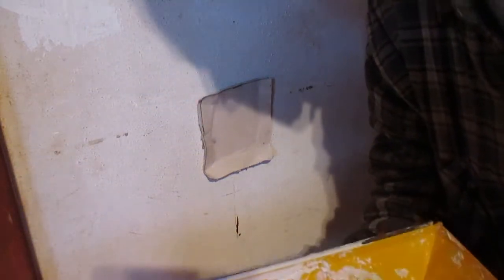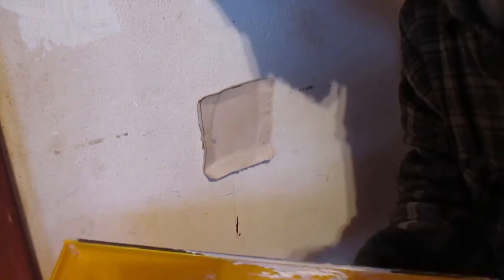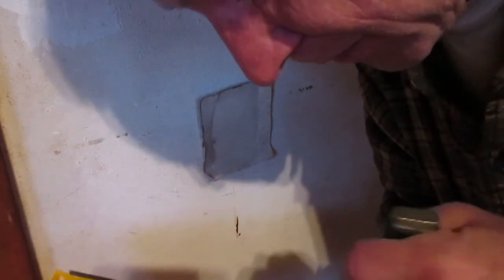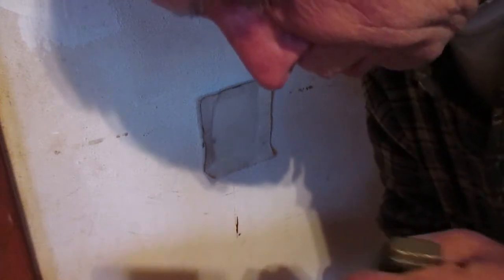I just got to mention too, guys, one thing you need is a good, about a 6-inch wide taping knife, this is called. Very essential, we gotta have that. And the mud is looking about right. We call it drywall mud, joint compound, there's different names for it. It's all the same stuff. Gotta get it thinned down enough where it's gonna be a little more workable.